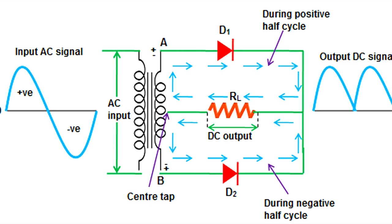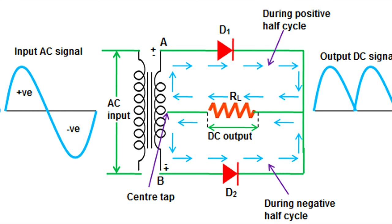Then on the other side of the transformer, the output side, you see that there are now two rectifier diodes and a center tap. And each diode works with one half of that waveform. So on the positive side of the waveform, we use that diode on the top to pass the output through. And then when the wave goes negative, the diode on the bottom side of the diagram, D2, passes current. And because it's a center tap transformer, the way that this all ends up working is that you get an output waveform that has, if you will, effectively flipped that bottom side wave up to the top.